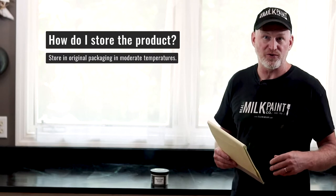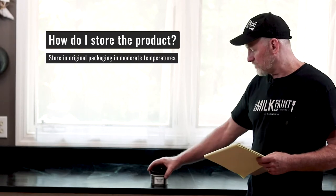How do you store the soapstone sealer? I just store it in its container in the refrigerator — it'll keep for an extremely long time. You don't want extreme heat or extreme cold; the refrigerator is fine but there's no need to freeze it. When you go to use it again, you might find a film on top — just peel it out and throw it away. That's polymerized oil, and the product underneath is ready to use.